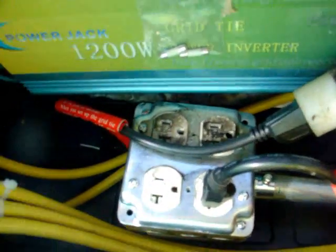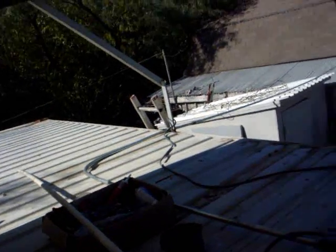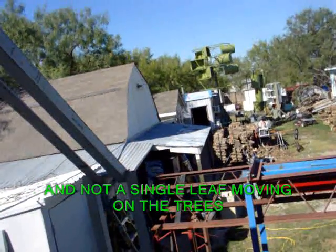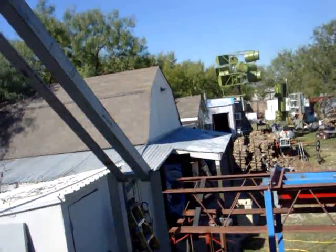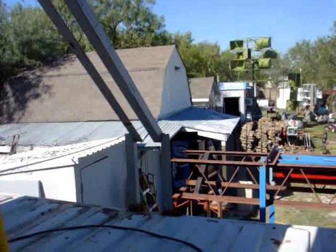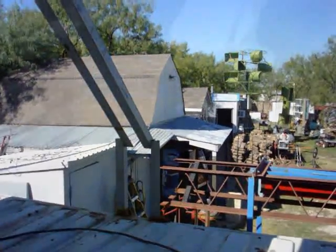This one is L1, this is L2, and this follows out into this junction box. The other one's hooked up the same way and runs out here, goes to that curve in the conduit I made with a bicycle rim because we didn't have a tube bender. It continues all the way across in front of that peak, across the porch, and runs down farther into the room past his office — that's where the electrical box is. The electrician will come by and connect that up. For now we might run two extension cords, one for L1 and one for L2, to give them half the power. Anyway, I'm Scott Brown with Green Wind and Other Home Energies — sorry about the beeping in the background.